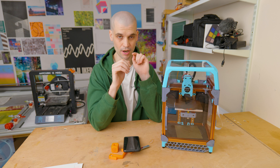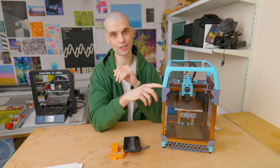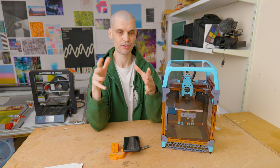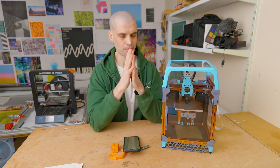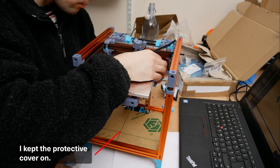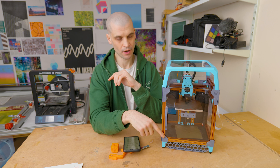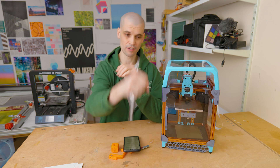I found myself shaking the printer to try and move a nut into position to push onto the bolt. I'd also use a little bit of blue tack to stop nuts from falling out when moving the frame around during initial setup, because that happened a few times. Lastly, with the LDO kit, make sure you peel off the acrylic protective covers before sliding them into the aluminium extrusion.